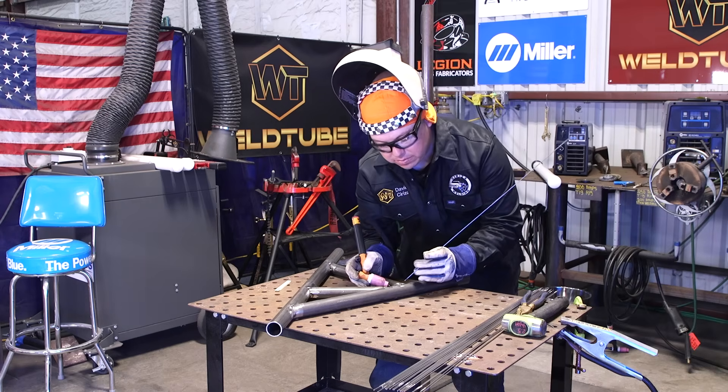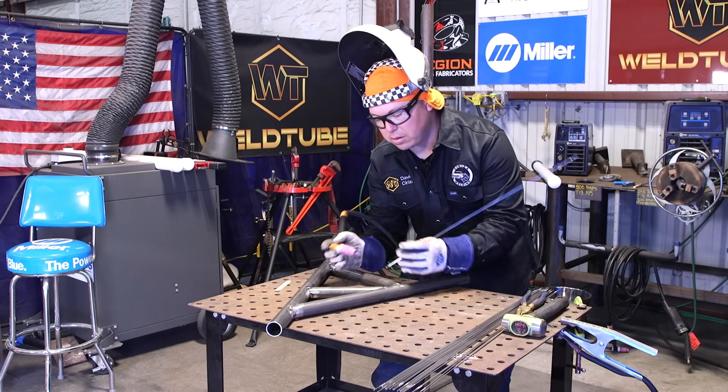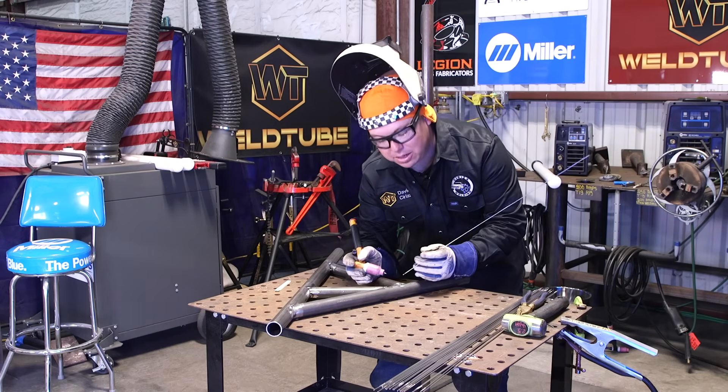I'm going to get started. I'm going to quarter different sections of weld just to kind of spread the heat out. Slowly stepping on the pedal, getting the arc initiated. I'm manually pulsing this with my foot as I'm seeing the puddle, just adding enough filler metal to get a nice profile. You leave kind of a worm-looking bead.